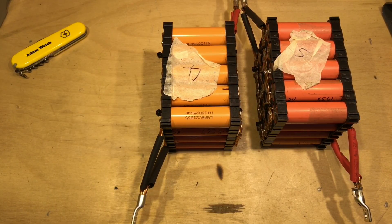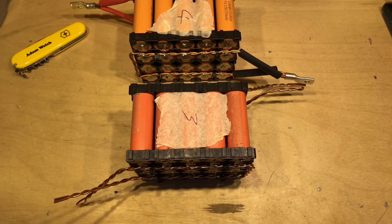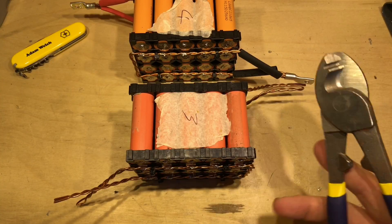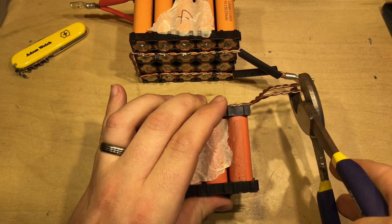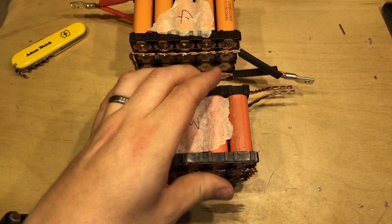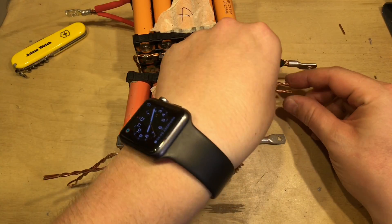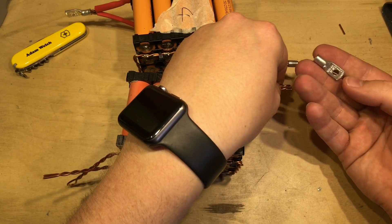One of the first things I need to do is cut the copper bus bar to about the right length. I've been using these cutters — they cut through the copper quite happily. Let's just get that through there. I think about there is about the right length, and now I'll find a crimp. With those two wires cut to about the right length, it's a matter of squeezing on this crimp connector.